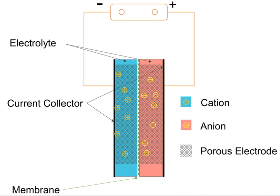Generally, the smaller the electrode's pores, the greater the capacitance and specific energy. However, smaller pores increase equivalent series resistance (ESR) and decrease specific power. Applications with high peak currents require larger pores and low internal losses, while applications requiring high specific energy need small pores.